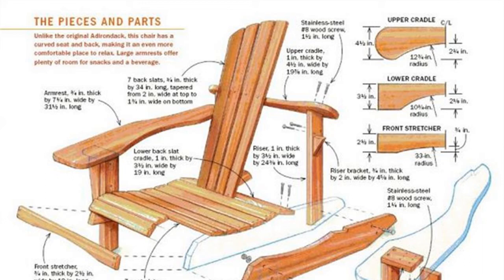4. Lay the back slats against the bottom back rail and the top back rail and attach, top and bottom with nails or galvanized screws. Lay the seat slats across the base rails, beginning in the front and attach with nails or galvanized screws.